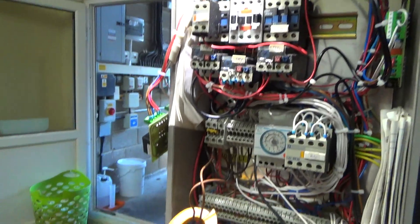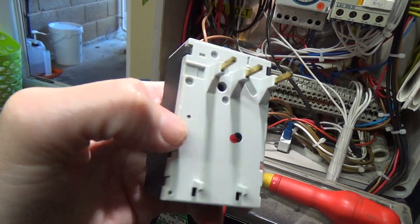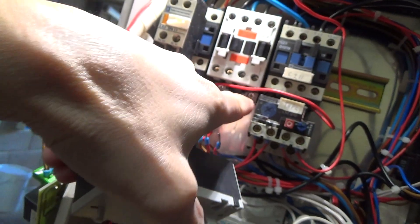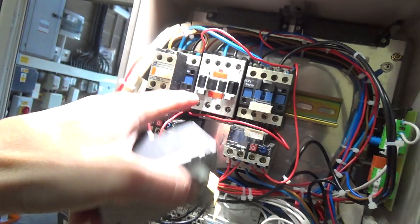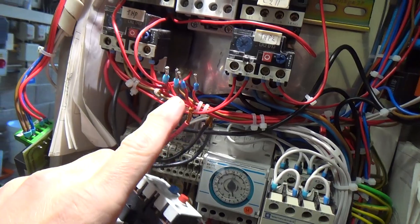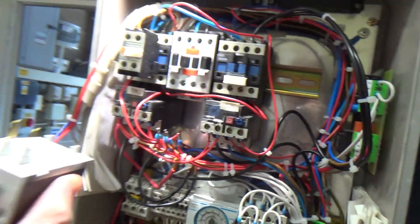Test things, people. Okay, these have a little pin which I've just cut off, which would go through into that terminal, which would mean you wouldn't have to put that link wire around to feed the coil. We're not using that because it's got all its internal wiring and we don't want to get involved in how that's done. So we've cut that off and we're just going to wire it conventionally.